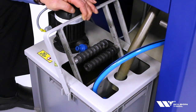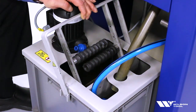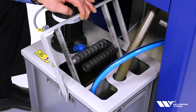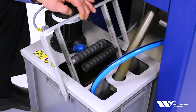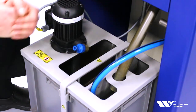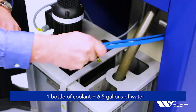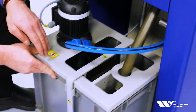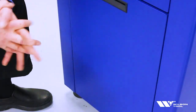This X-Sharp grinder does not use a paper filter system — it uses magnets to collect the grindings and swarf from grinding. To service it, you simply wipe the grindings off the magnet and replace the magnet back into the tub. We're going to add the bottle of coolant and six and a half gallons of water. Once you've done that, you can reconnect the pump hose, slide the tub in, close the door, and now you're ready to go.